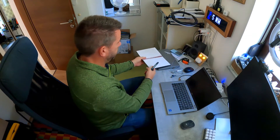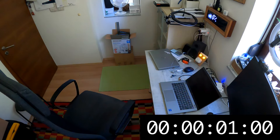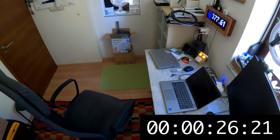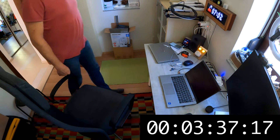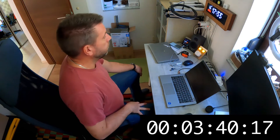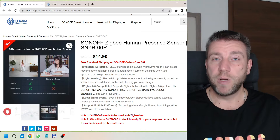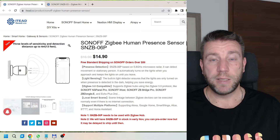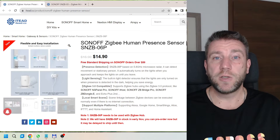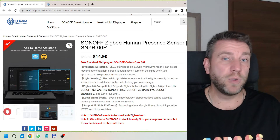I also tried leaving the room and closing the door behind me. Turn-off time was pretty much the same — about 45 seconds for both sensors to go off. But interestingly, when I came back in and opened the door, the radar sensor actually detected motion quicker than the PIR sensor. That's probably because my body was blocked by the door, so the PIR couldn't pick up body heat, but the large moving surface of the door itself was picked up by the radar sensor — showing that radar doesn't rely on body heat and any motion can trigger it.